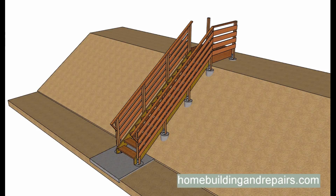While I was taking pictures in San Francisco one time, I took a picture of a stairway that kind of looked like this. I'm going to show you the picture at the end of the video, but this gives you an idea about using posts and concrete footings to provide additional support for the stair stringers and for the hand railing with the posts and footings.